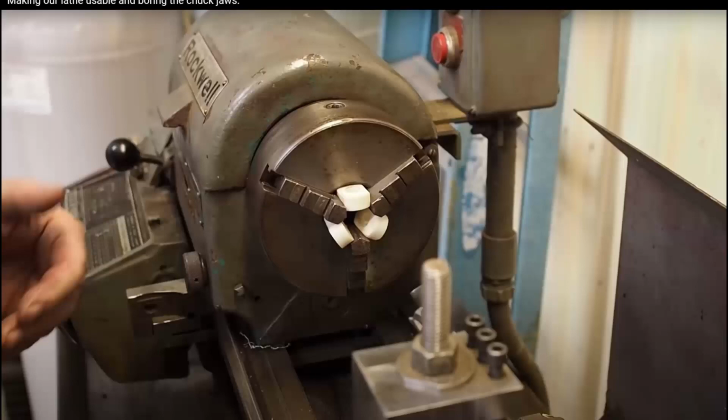I didn't fancy using the lumps of plastic to push the jaws apart, because when I tried it on my lathe, it looked to me as if they were going to fly out of the chuck, and as they got cut into by the boring bar, would probably cease to push the jaws apart adequately. So I tried something else.